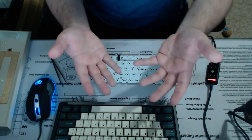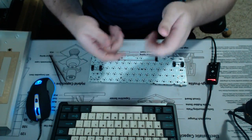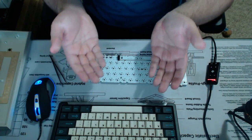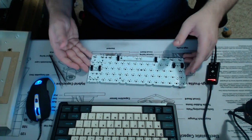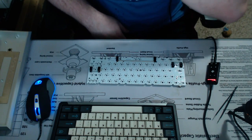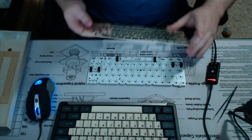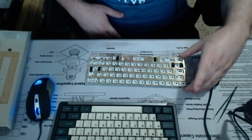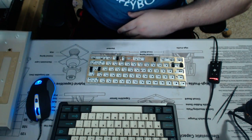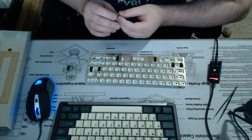So when you lube a switch aftermarket, especially on linears, you apply a little bit more to the leg, and you do thin coats on the walls of the slider and the rails, and some people lube the springs, and there's more to it. So that's how it goes. Yep, exactly. Stock lube is supplementive, and aftermarket is transformative.